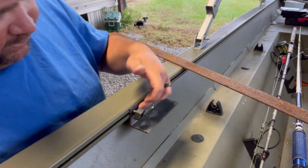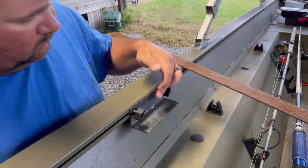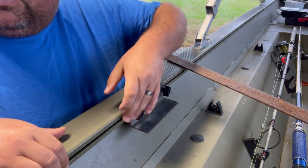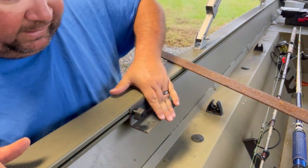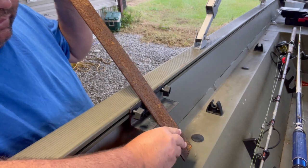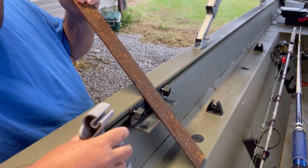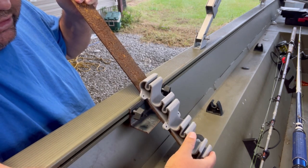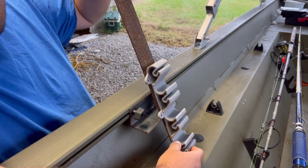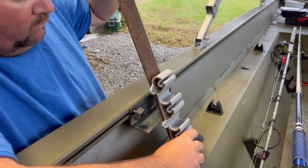What I've come up with here is a two-inch by two-inch piece of steel angle iron, an eighth of an inch thick. I drilled two quarter-inch holes right close to the edge so it'll mount in my Versa Track rail. I've got some thumb screws on them and mounted it down. The idea is I'm going to mount another piece of steel on an angle — the rod holders are going to sit on this steel, but I want it angled up and sitting on top of this shelf area from here to my gunnels, which is kind of wasted space anyway.